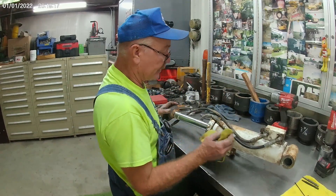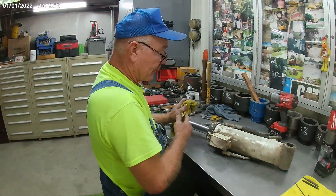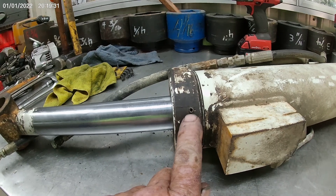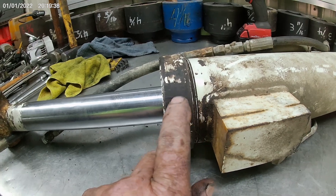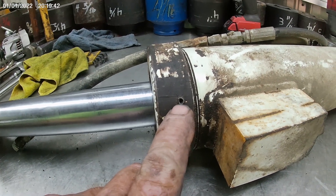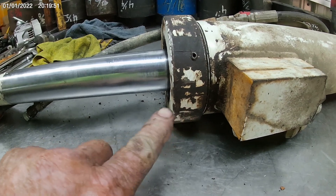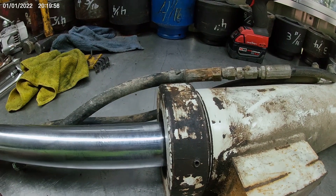I was looking at it here this morning. If you look right here, you'll see that on the head gland it has two Allen set screws that go in, and it sets against the thread to hold this head gland on. This one here, if you look at it, you'll see where it's damaged. It's going to be fun to get that out. You'll also see there are no spanner wrench holes — nothing in here other than pipe wrench marks all over it where it was probably resealed at one time.